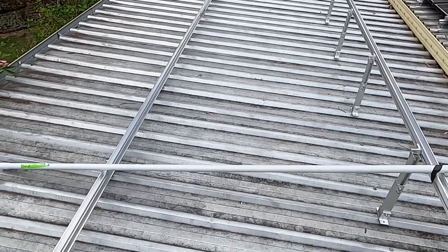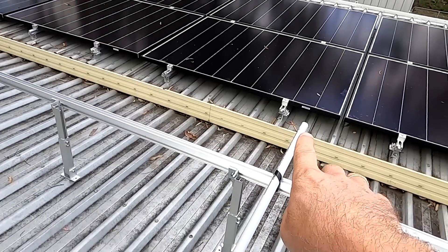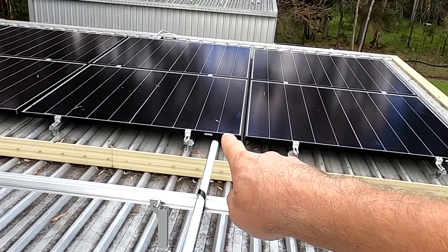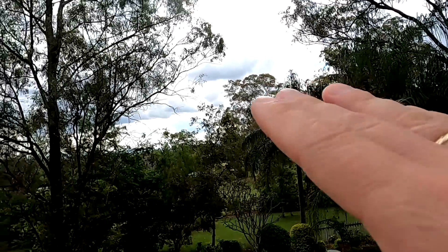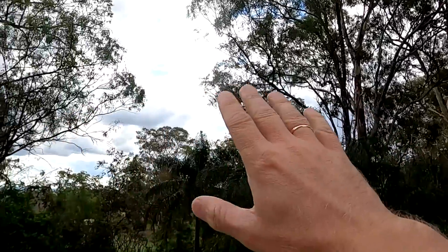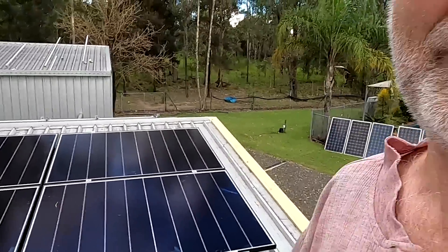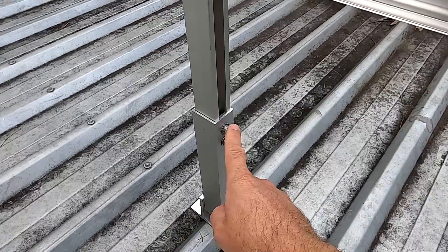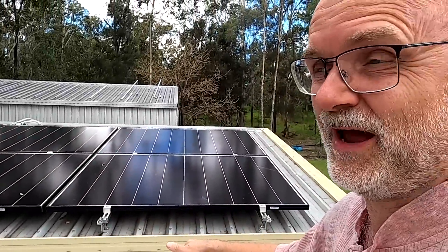This is roughly the length of the solar panel which will be installed in this location. Now if you look over this corner there, once they are touching the other solar panels, this gives us the angle of the sun - so it will be fairly down already. I told him I'm not too concerned about summertime because then we will have enough power anyway. It's more about the power we are getting in wintertime. A bit steeper pointing to the west, we get this nice window in wintertime which shines on the west roof. I can always come along and lower these supports here a bit to find the optimal angle - but we need to wait for wintertime for this to happen.